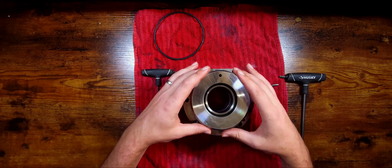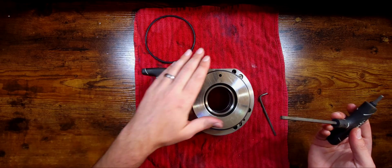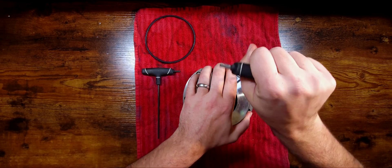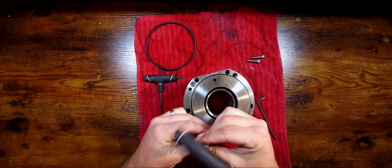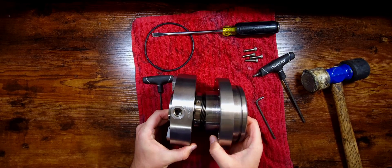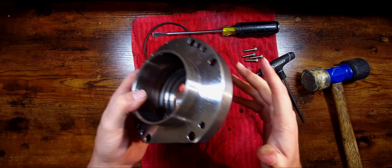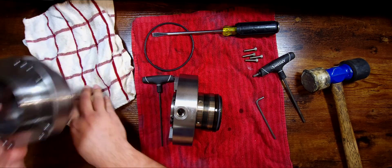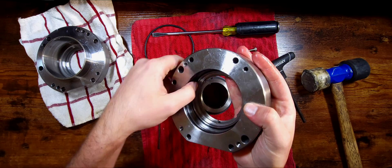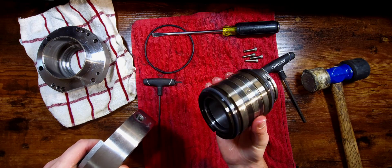On some of the older ones, you did have a multiple-piece breakdown, but on the really old ones you actually just had almost like a flat plate — it wasn't even this intricate. That plate just slid over the shaft and had some seals in it to seal the shaft, the O-ring, and whatnot. It was a lot simpler design. This one has gotten a lot more complicated. We've got these four bolts here on the back side — this is the side that sits in the refrigerant stream. You've got some oil ports and things in here, and then we've got a 3/16th allen we're going to bust these open with. This is your rear housing — at this point it's just a hunk of metal, so we'll set this off to the side. This is your outer seal housing, and you can see there's a series of O-rings in here as well. This is where your main seal assembly slides into.